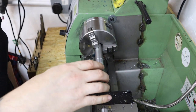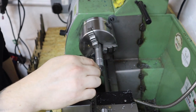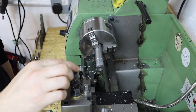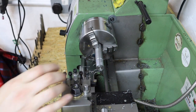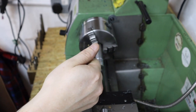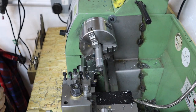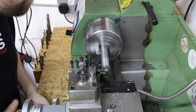Something really convenient about these tools is they all seem to have the same centre height, so if you're limited on tool holders you can just switch these tools out fairly quickly using the same tool holder. I'm going to switch this out now for a chamfer tool and test it putting some chamfers on here, and also a few plunge cuts.